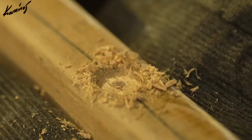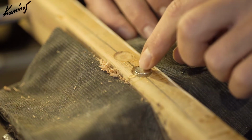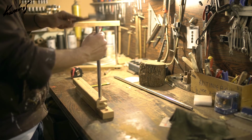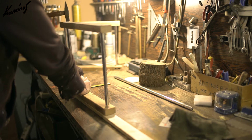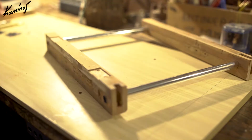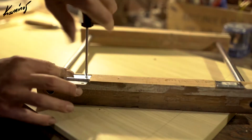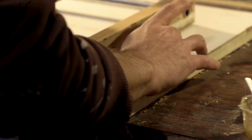Now it's time to drill a hole for the magnets. This is epoxy adhesive. It's very efficient in bonding different materials together. The pipes fit very tight in the wood, so any adhesive or other tightening method is unnecessary. The first leg is complete, so it's time for the hinges. Pre-drill and then screw to avoid wood splitting. Some extra holes for more magnets on the main board.